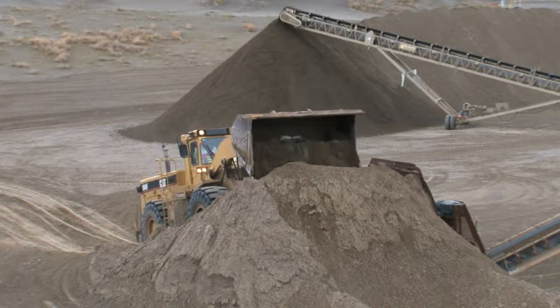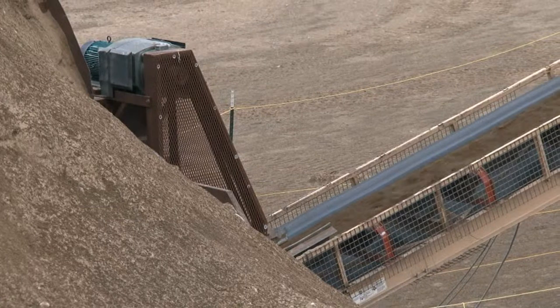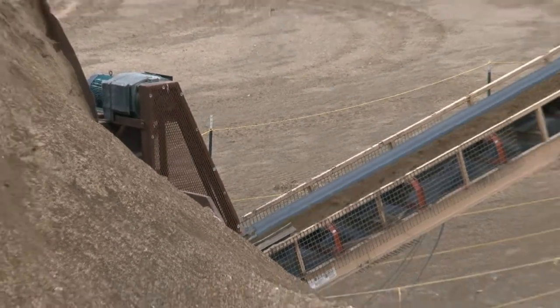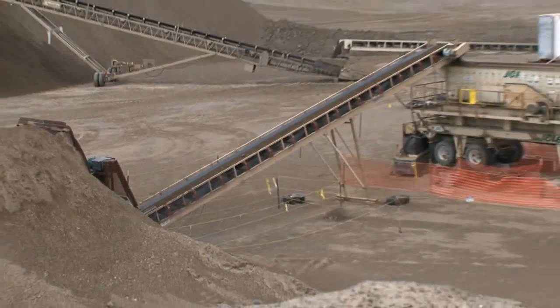The compacted soil liner, or admix layer, is made with soil and bentonite. The collection system collects and removes liquid, or leachate, as it drains through the waste materials.